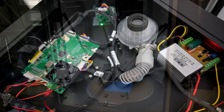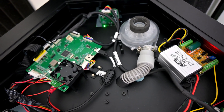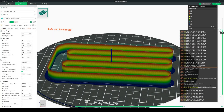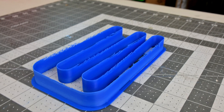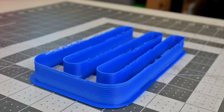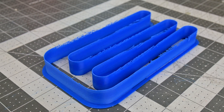To keep the effector lightweight, the cooling fan is located at the top of the printer, and a large hose is used to direct the airflow down. The cooling fan does an excellent job at immediately cooling the material, which is necessary when printing at speeds up to 1200mm per second. FL Sun advertises a max volumetric flow rate of 110mm³. Running flow rate tests with a handful of different high speed PLAs, I found the hotend started to struggle at around 90mm³. That is still incredible and means the machine will be able to hit 1200mm/s quite frequently, especially at thinner layer heights.